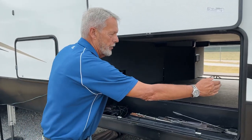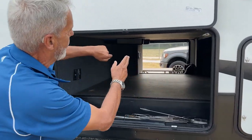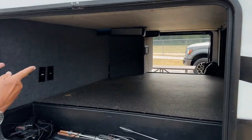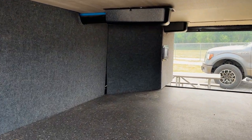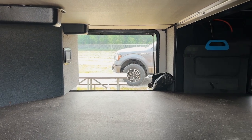As far as what width to put in there: you want to measure the narrowest part of the cargo slide that the door will be coming out on. For example, here you see we have a very wide compartment, but then we look on the other side and we have a narrow section on it. So we can't do the widest part — we always have to go to the narrow portion of the compartment.